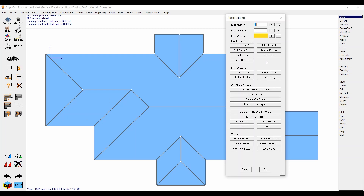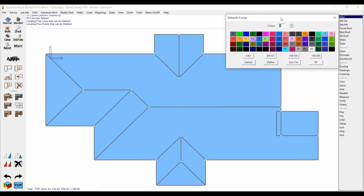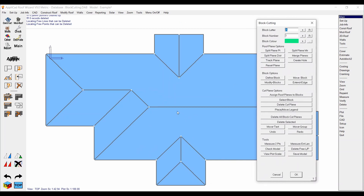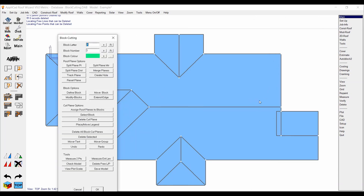Just trimming and cleaning it up can go a long way in reducing any stress later on. The main technique with a block cut is you want to split the roof down the main ridge and try to simplify it down into a four-hip roof. Sometimes there'll be multiple four-hip roofs in one job, but the main goal is to simplify it down to a four-hipper. We'll split this end and chop that up — this end is simpler because we've got a gable end — and we can tackle these two different types of dormers in different ways.